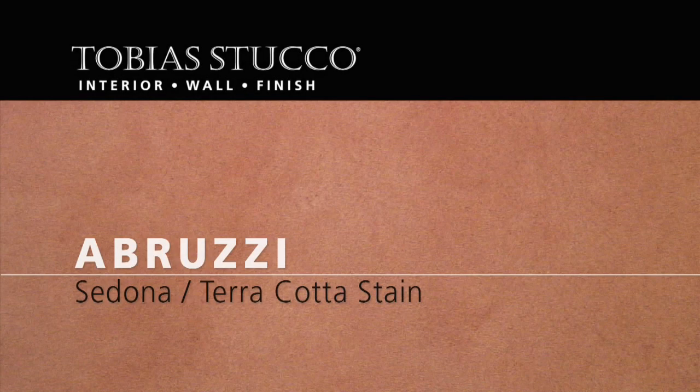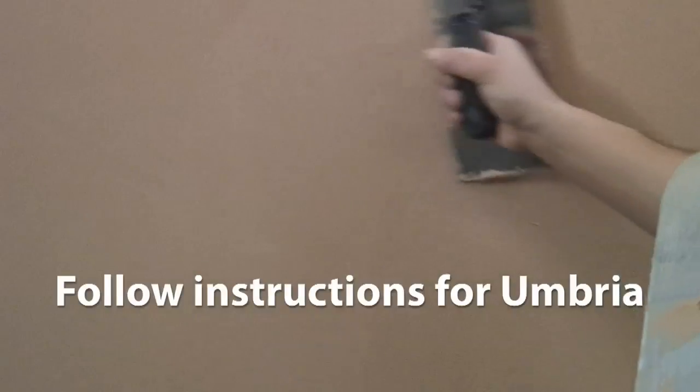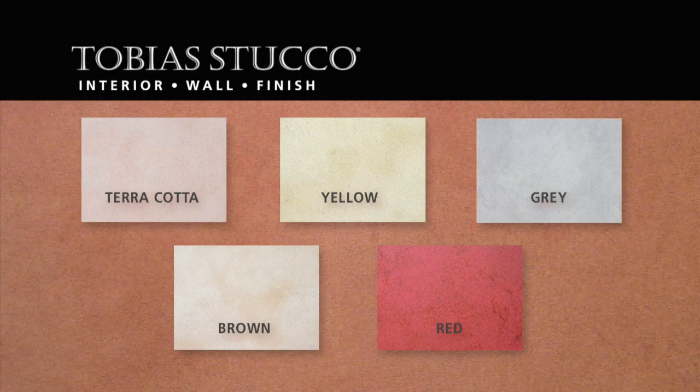Abruzzi, three-coat process. Abruzzi is a Tobias Stucco texture achieved with stain over the Tobias Stucco Umbria texture. Follow instructions for Umbria. Tobias Stucco stain comes in terracotta, yellow, gray, brown, and red. Each can be used separately, or once dry, one can be applied over the other for more depth.